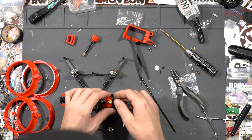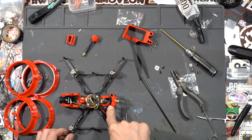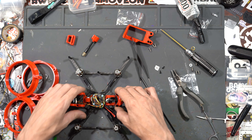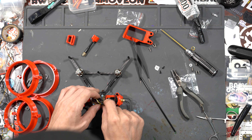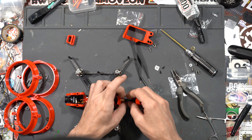Before we put the SMA mount on we'll put the receiver in. I've got this little plate screwed in and now we're going to use some more E6000 to glue it down — just run it right along the side. Make sure we're not covering any LED lights. You don't need a ton; it just keeps it from falling out. We won't mess with the antennas right now — we don't want to disturb the receiver while the glue is fresh.